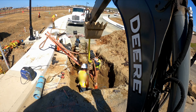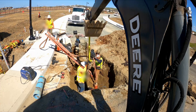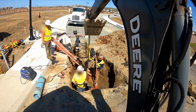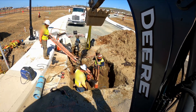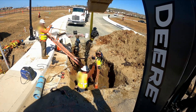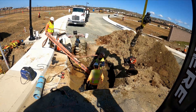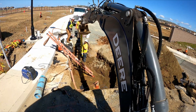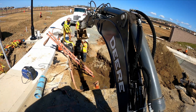It looks like the water is just about all pumped out. We're going to go ahead and pull out the stand pipe — or the 90 with the reducer and everything on it — set it to the side and out of the way. Make sure you're setting it somewhere you can pick it up and move it out of the road on the job site. Because I set myself up in a good position, I was able to reach both of the risers from one position using the extenda hoe and the backhoe.